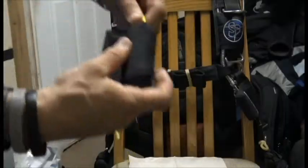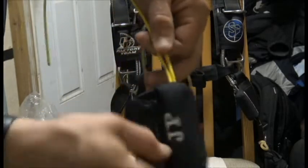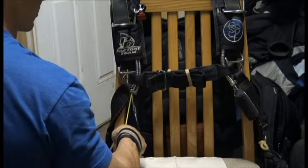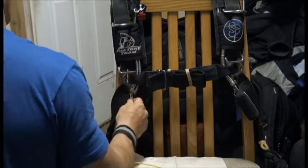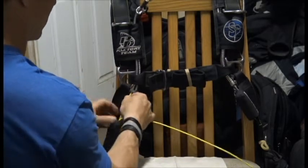You can see these cables are much cleaner now. There's a swage ball inside of our handle — if we twist it to align it just appropriately, that way we don't have any twists coming from the cable through the housings or from the handle to the housings. Looks a little bit better not having the twists in there.